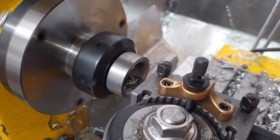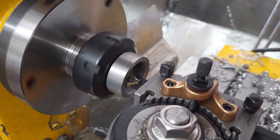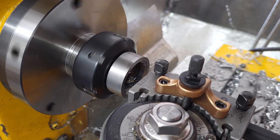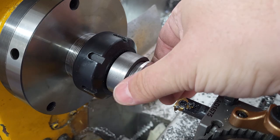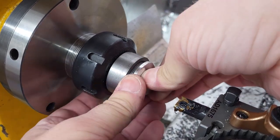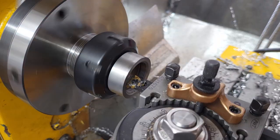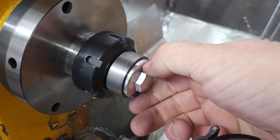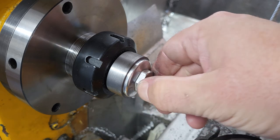When we do our threading, this is a G76 G-code threading routine. It's a wee bit tight, which I expected because I hadn't put in any tolerances for clearance. So I added an extra pass out of the routine and ran it through again, and now it fits perfectly.